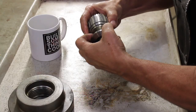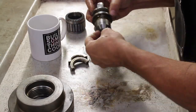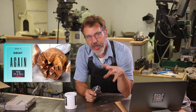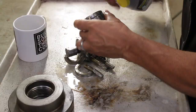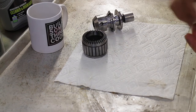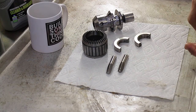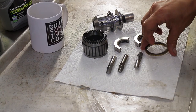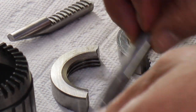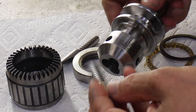The first thing we need to do is take the chuck apart and clean it up inside and out — we want to get rid of all the grease, because the grease is going to attract any of the grinding dust. We're going to grind the chuck jaws in the chuck itself. When you grind in the chuck jaws, you need to put a force on them so the jaws are pressed out so that when they clamp down on something, they're in the correct position. We need to do the same thing on this drill chuck, so we're going to take advantage of centrifugal force. We have two bearing surfaces that need to be in contact, and when they're fit inside the chuck, they need to press into position.